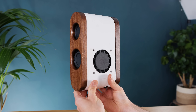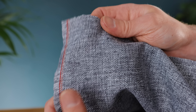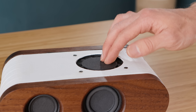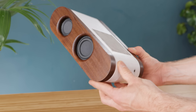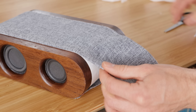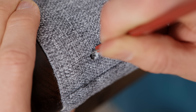The last thing to finish it off is complete the aesthetic with some fabric. You can choose pretty much anything you like — it's a great way of achieving different styles — though do try and use something that's reasonably acoustically transparent so that it doesn't interfere too much with the passive radiator. You may also want to cover the passive radiator with some mesh to prevent it from getting damaged if handled improperly, though do ensure there's at least a 4mm gap underneath so that it doesn't rattle against the radiator. I'm using some nice grey fabric here, and mounting it is pretty easy as the edges can just be folded over and carefully glued with super glue, with some glue spread over the areas covering the threaded inserts to prevent fraying once the fabric is cut, which allows some speaker feet to be screwed in place.